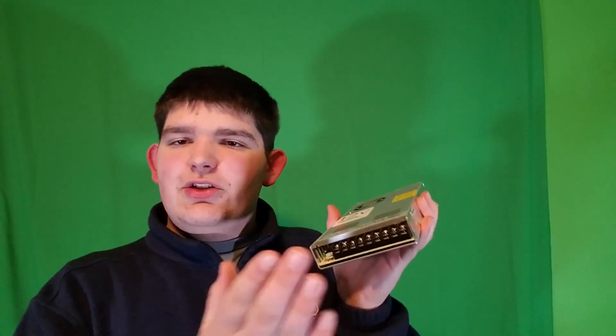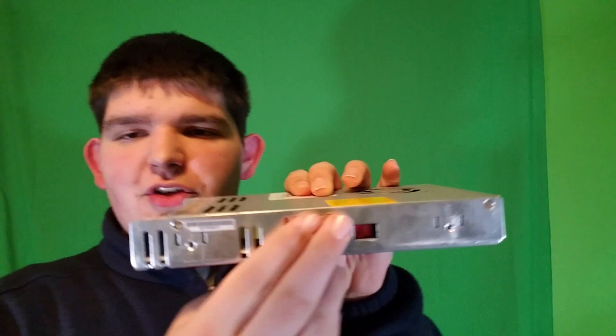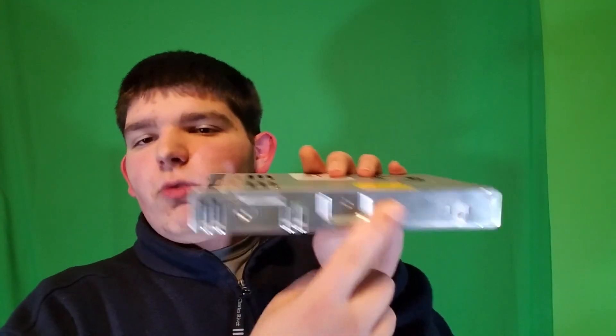I have all 12-volt pixels. So you might be wondering, how do you get the voltage from 120 volts AC down to 12 or 5 volt DC for the lights? What you use is called a power supply. This is a 12-volt power supply from Wired Watts. You connect your power up through here through an extension cord that you screw in, and then it converts the power down to 12 volts DC and outputs it on the other terminals. You can also buy these for 5 volts DC if you're using 5-volt pixels. They have a switch — if you're using 120 volts, you'd set it to 120 volts, and you can switch it with a screwdriver if you're using 230 volts. That's how you get data and power to the lights, and then the lights should be working.